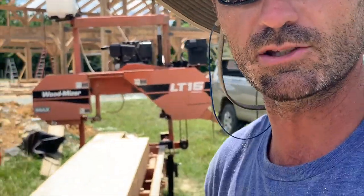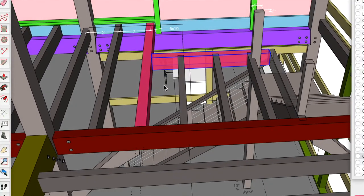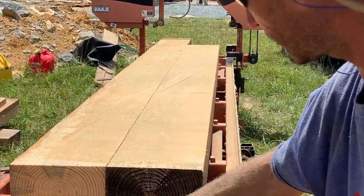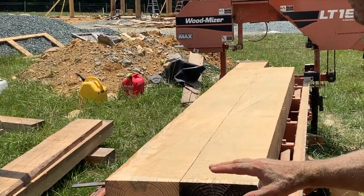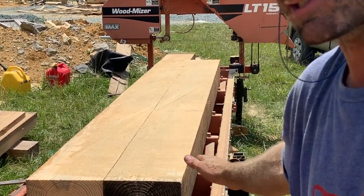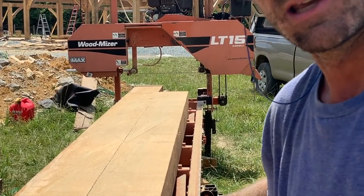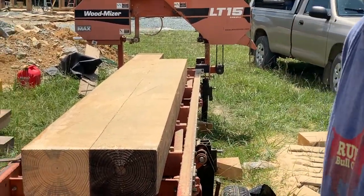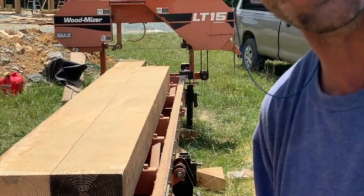What we're doing here is taking two ten by ten scraps and cutting them down to six by tens for our stair header in the loft floor framing. These were center-cut ten by tens — the tree was probably only 16 inches around. So instead of just taking four inches off one face to get a six by ten, we have to cut two inches off each face so that it dries evenly and doesn't warp or twist as it continues to dry. We're going to roll these over, take two inches off the other side, and we'll have two six by tens.